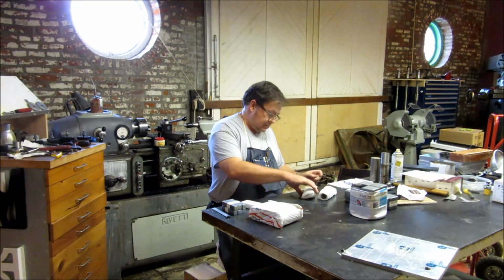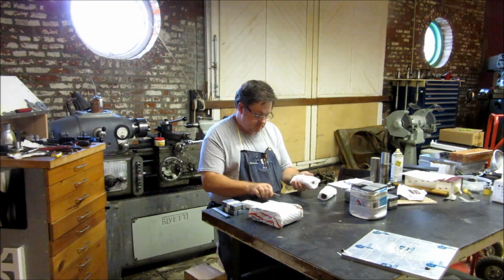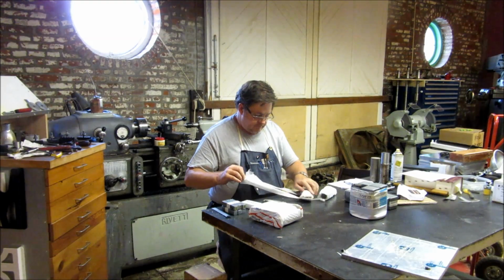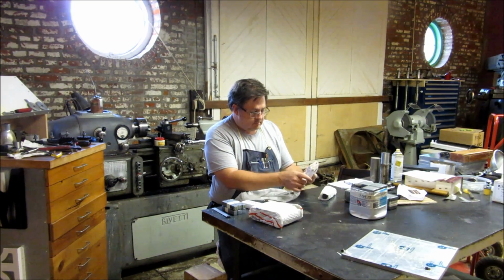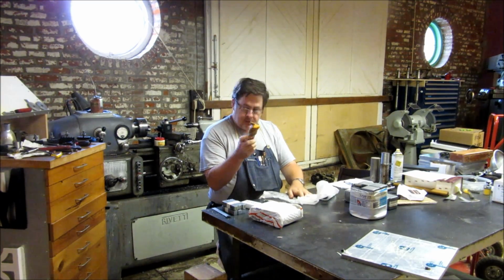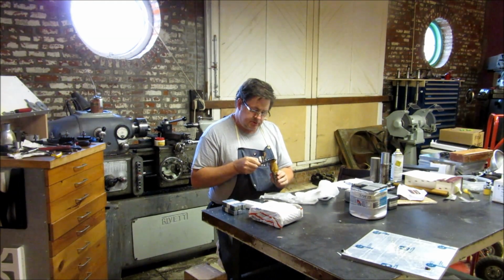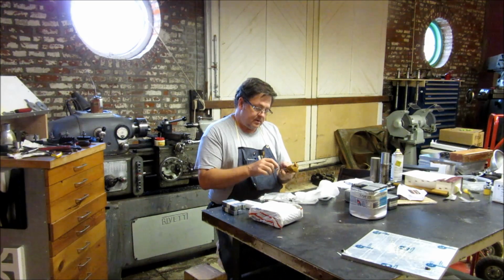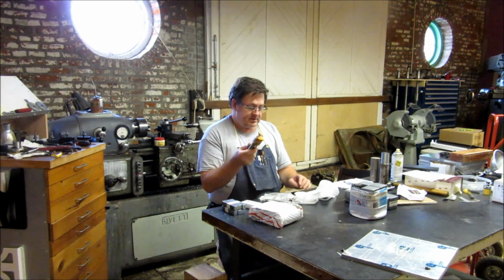Okay. Gotta be careful, this stuff will cut you. Feels like a 2 flute. Yeah, there we go. That's a 2 flute, 2-inch with a 1 1/4 shank, 2-inch length of cut. It's a tin coated mill. This is an aluminum cutter here is what this is.